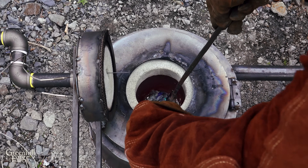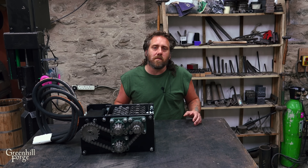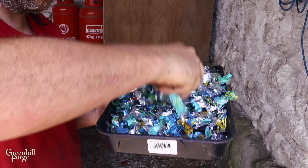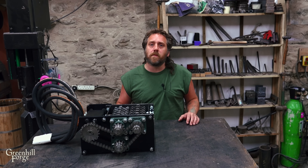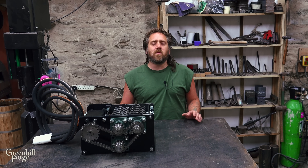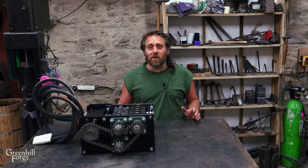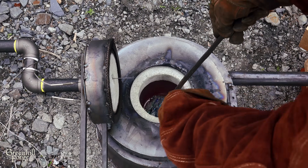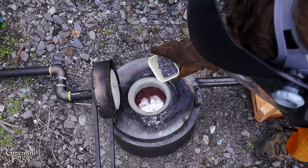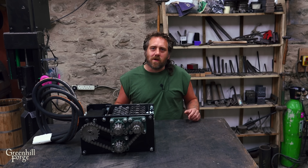I'm finally ready for the aluminum melt and pour and I'm super excited about it. I've spent a lot of time designing a process that I think has the potential to give some pretty good quality aluminum from just old saved-up cans. A lot of you have mentioned using better quality casting aluminum like engine heads and tire rims, and I totally agree, but this project was born about five years ago when I just started collecting beer cans. So I'm going to be using the cans, get the melt as clean as possible, and add some elements to alter the material to work well for casting and machining parts, and finally pour and cast my own custom aluminum alloy.